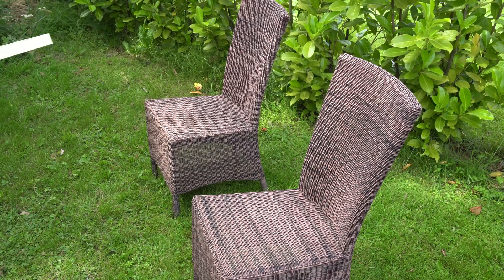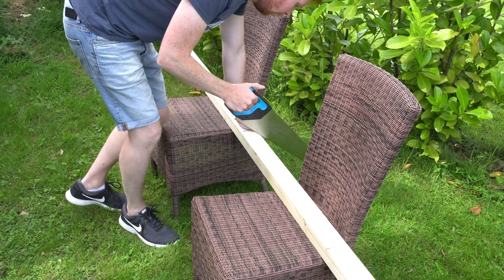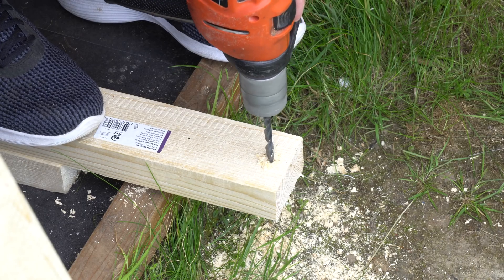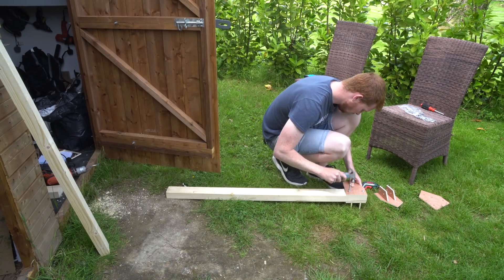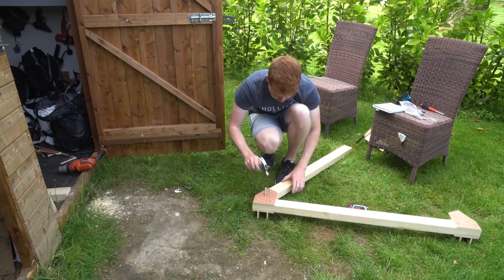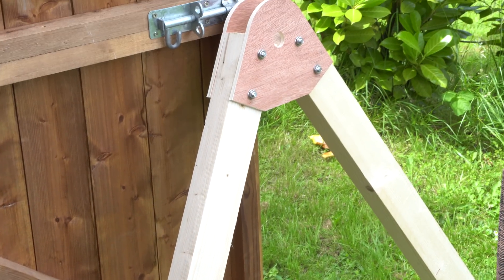For the main beams I'm using pine with 45 by 74 millimeter cross-sectional dimensions, cut to the same length as the CAD model. I then drilled the holes for the M8 bolts to see if it all fits together. The thick wood beams might seem overkill, but I chose to over-engineer the frame just in case I wanted to try some really high counterweights. A few bolts later with the axle plates in position, one half is complete.